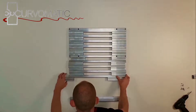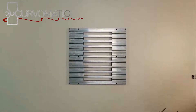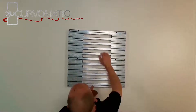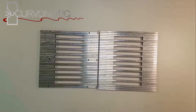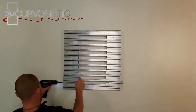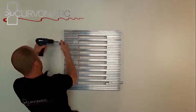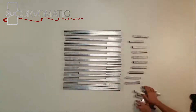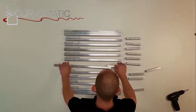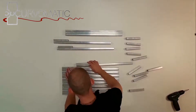The outside and center extrusions should be drilled to fix the skin to the formers. Repeat this process to complete the mold skin. The clamping skin is constructed in the same way but without drilled sections and with the addition of one extra full length on the outside edges. A double hollow configuration — meaning two gaps between the full lengths — is suitable for most laminating work, but a single hollow setup with only one gap is better when applying thin surface veneers. To turn your double hollow kit into a single hollow kit, just remove half of the short lengths. This will however reduce the working width of your kit by around a third.